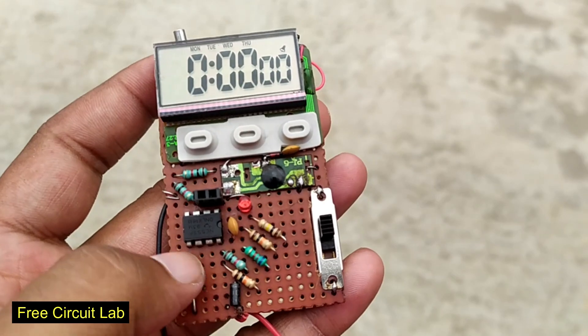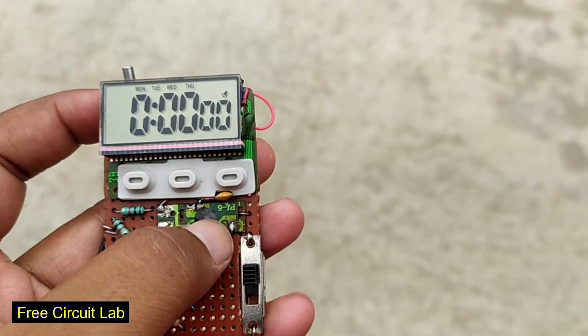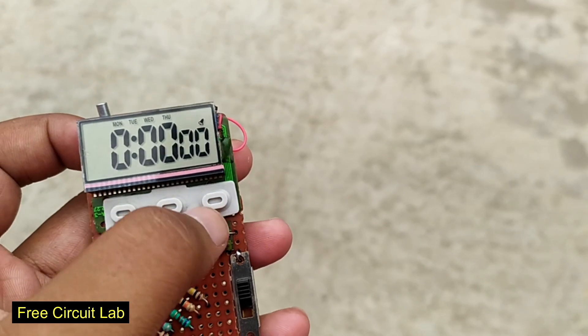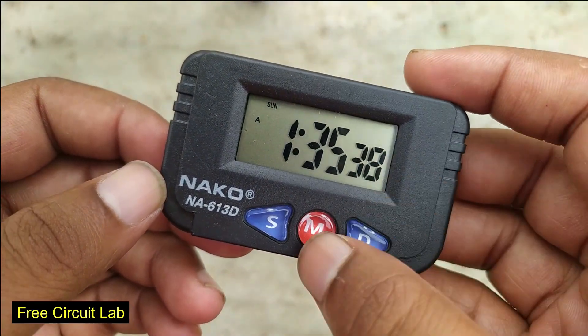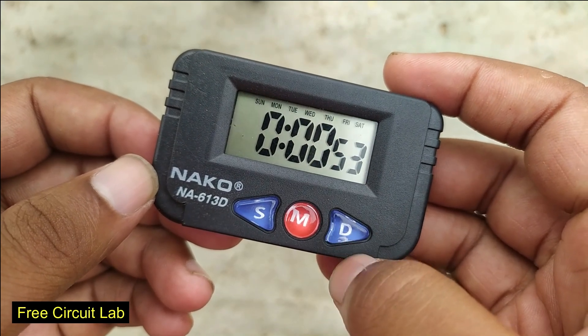The frequency of the oscillator will be set by our test capacitor. We have a pulse counter board which counts input pulses and outputs a pulse at every 65,000 pulses at the input. So its output will be slow enough to drive the stopwatch — 1 second for 1 nF — which can be calibrated by our frequency setting resistors.